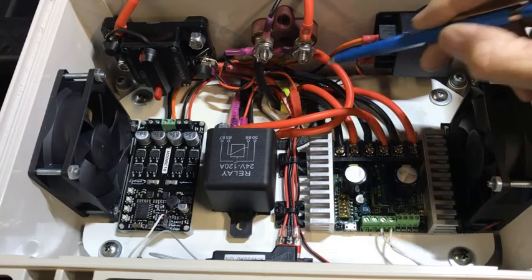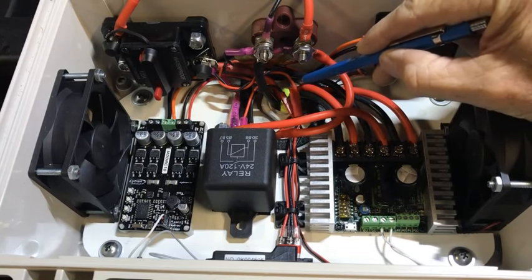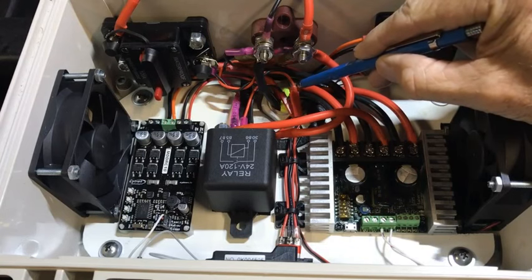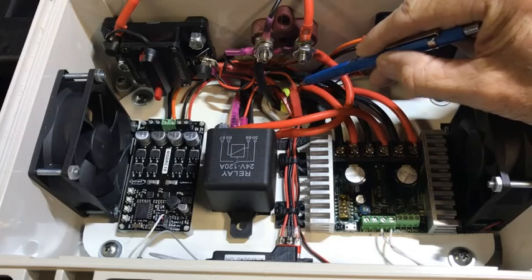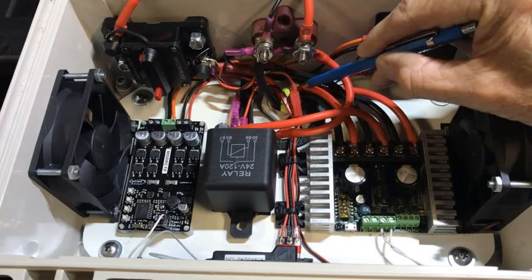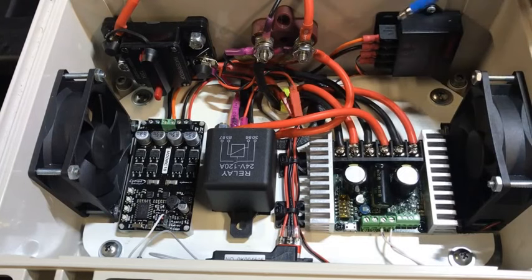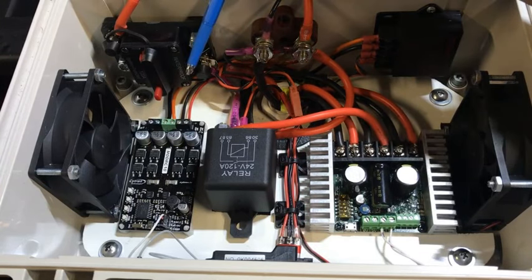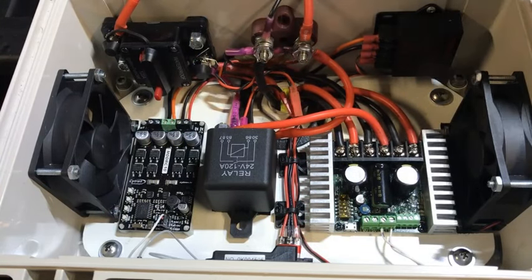All wiring entering and exiting the enclosure goes through a 3/4-inch gland nut. When you tighten up a gland nut, it cinches the cabling tight against each other. You still have spaces where it's not exactly airtight. So I pushed in foam air plugs to fill up the larger gaps. I have a Sabertooth 2x32 motor controller and a Cytron dual 10-amp motor controller RC.